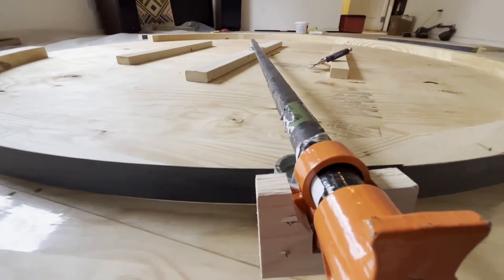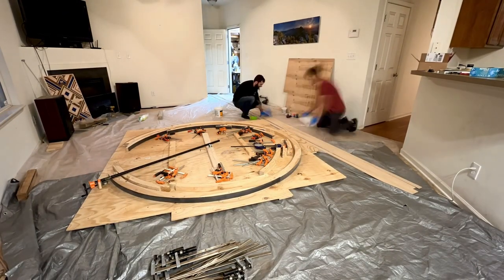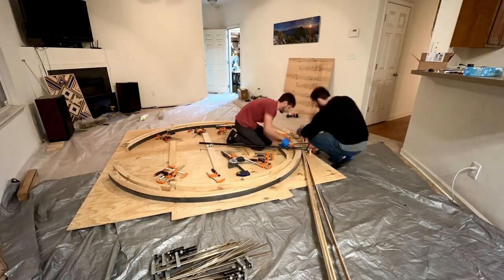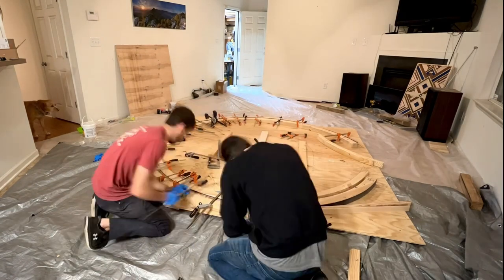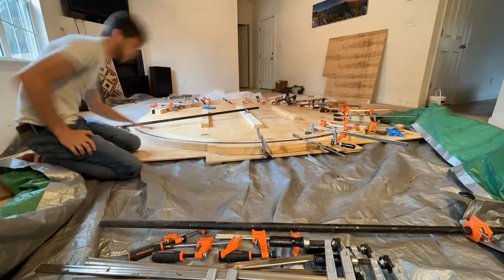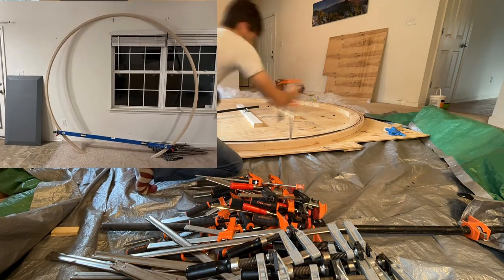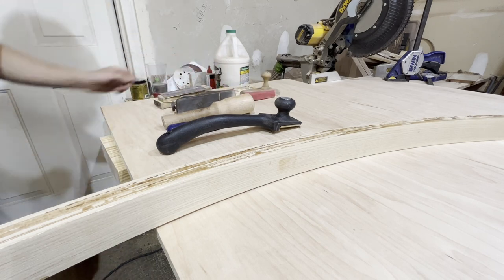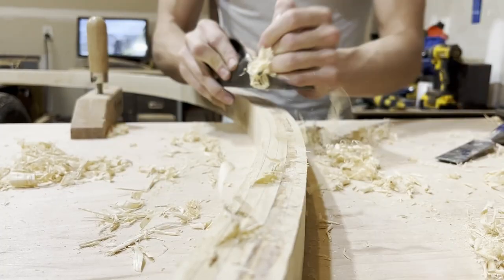After some workshopping, I came up with a solution: a clamp mounted on a caster wheel to press the plies into the mold. We used a urea formaldehyde glue, which is supposed to prevent slipping once it's done gluing up. We just worked it around the mold — this took a ton of clamps. Thankfully my friend Sam was around to help; having an extra set of hands was absolutely invaluable. It probably took a good 30 minutes to take all the clamps off after about 24 hours. I gave it a really good amount of time to set up because I didn't want spring back — a lot of times when you pull a bent lamination out of a form it can spring back. Cleaning it up took all kinds of scraping and hand planing, checking for square, but I think it turned out pretty fantastic.